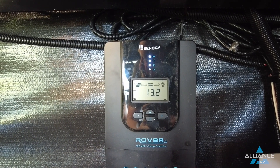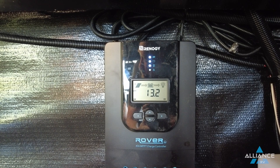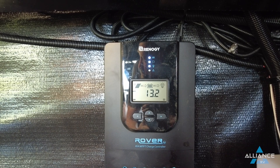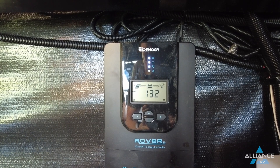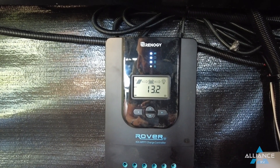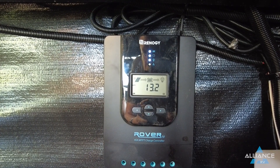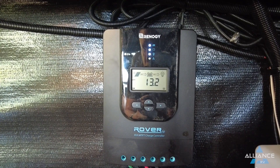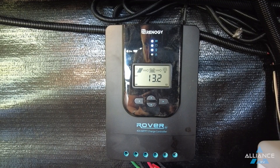It's a very simple display — it just works all the time. It is connected to the battery directly, and on this package there is one lithium iron phosphate 100 amp-hour Renogy battery connected at all times, so when you're parked in a storage lot or in your yard, the two panels should be able to keep that battery charged with ease. The controller has been relocated up here, closer to the battery, so everything is in one area and it doesn't get bumped in the baggage compartment.